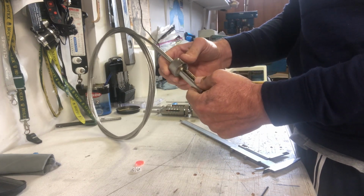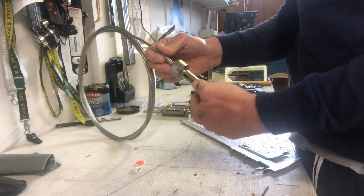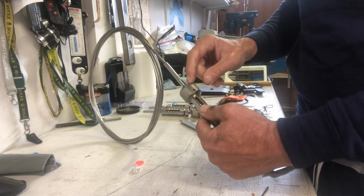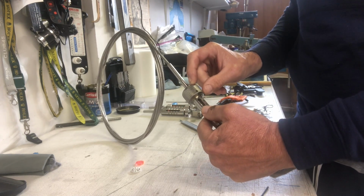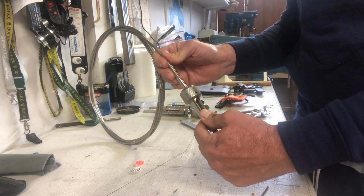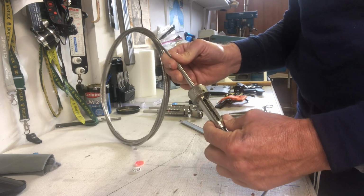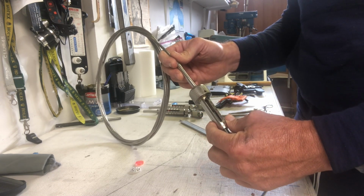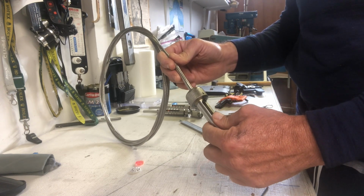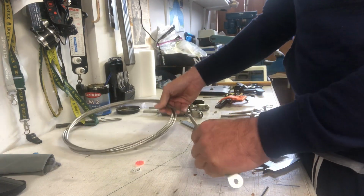The Brolga does require more regular servicing, which requires the unit to be taken apart. And inside here, there's a thrust washer, which is essentially 10 ball bearings that are encapsulated between 2 ball races. They do require lubrication. Over time, that lubrication does dry out, so it's something you need to keep on top of if you want the turnbuckle to work properly.